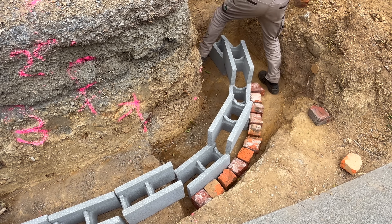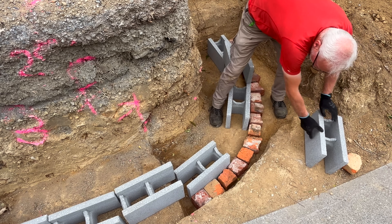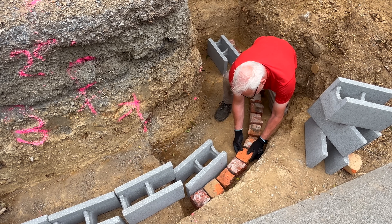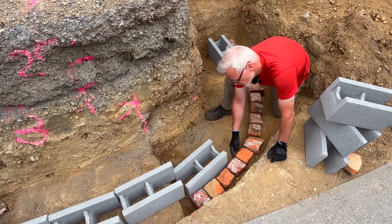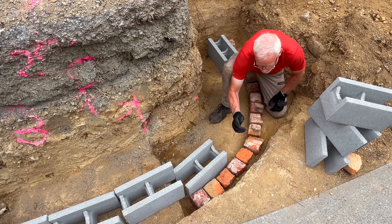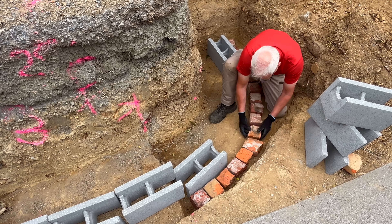That curve isn't very curvy — it's great at the beginning, very straight in the center, and then it doesn't really know what it's doing towards the end. So the better thing to do is remove these blocks and get those front bricks exactly where I want them. I'm looking at the curve of the brickwork and also paying attention to this joint in the center. I'm going to butt them up against each other so they're touching at the back and open at the front, and when mortaring these in place I'll just take a slip off the side of these bricks to bring it all level.